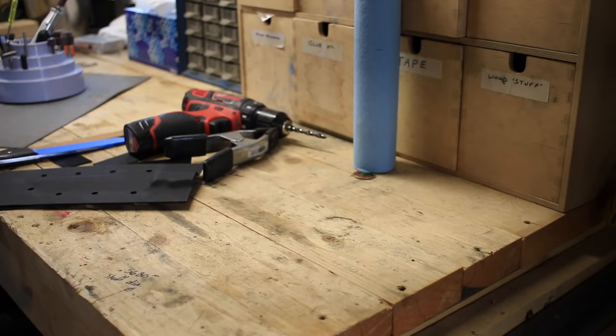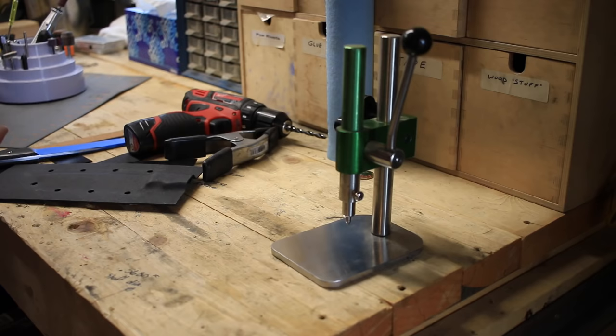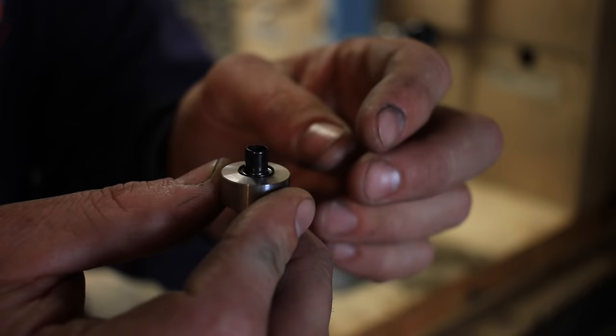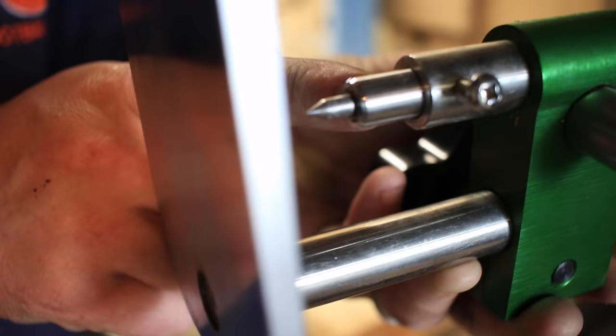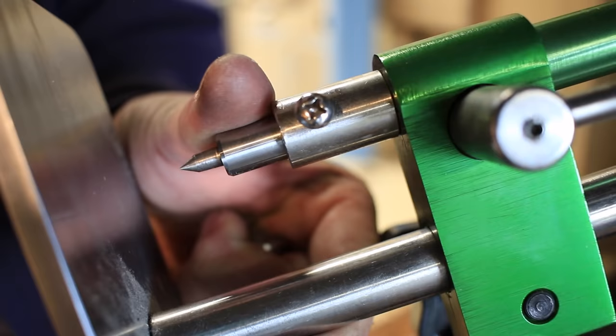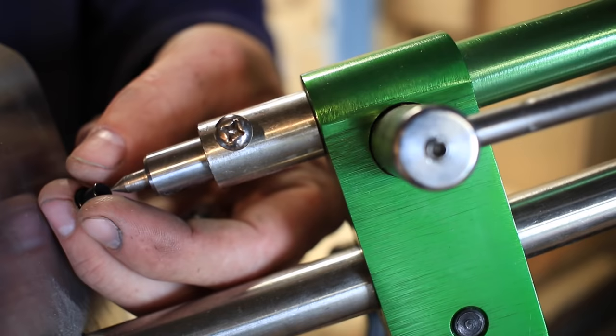This is my cute little press. A bit of a joke, I understand that, but all it really is, there's a bottom die. It's kind of got that recess machined in there, and then you put the preformed flange into that die like that. There's also got that same little recess. You can't see it, but it's on the inside of that. Well, you kind of see it there, and so this will kind of help locate it. This little pin here on this little chingus, it also locates it within the die, so you're not going to mess up your die. And then as you press it down on this part that does not have the preformed flange, it basically rides up in there and gets flared over.